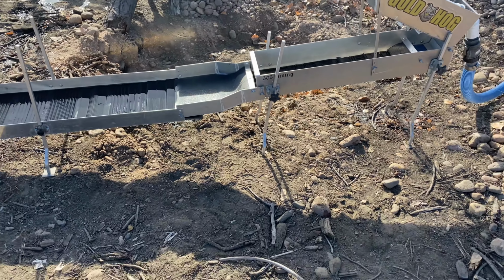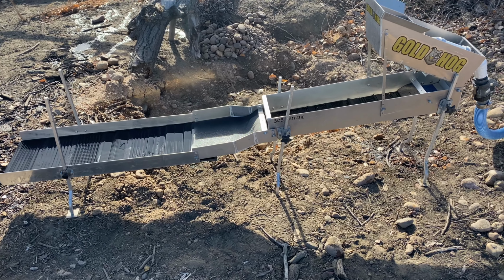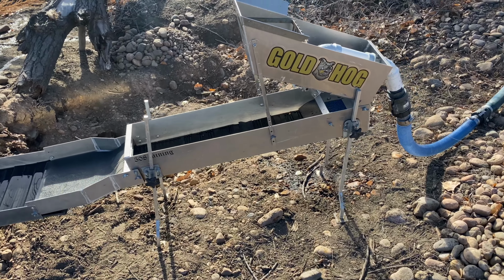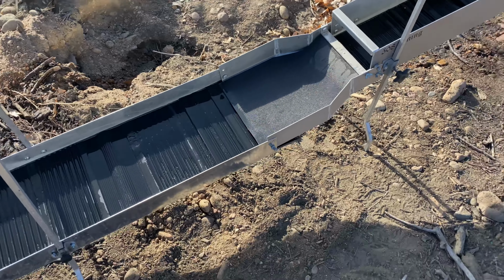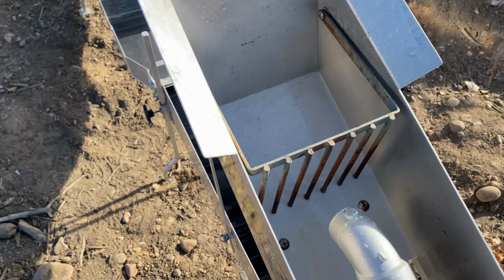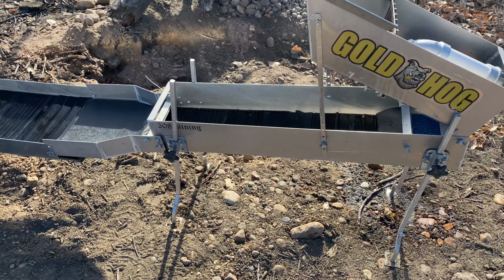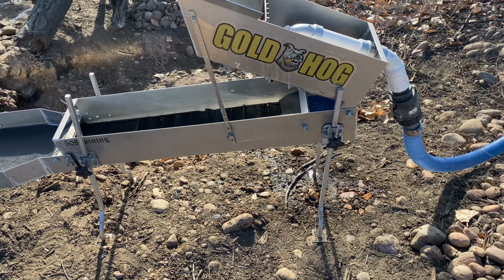Well, today kind of turned out to be a fail. My plan was to run two 4,700 bilge pumps with 50 feet of 2-inch lay flat. I've done it before, but I got about 8 feet of head lift here, and it just isn't enough for the little Piglet. It needs twice as much easily.